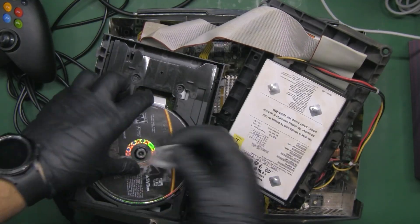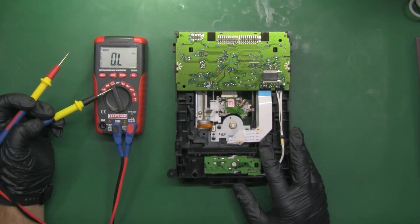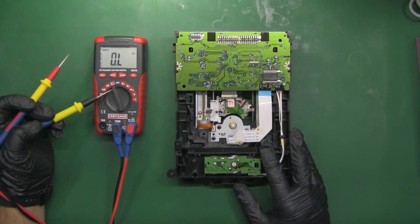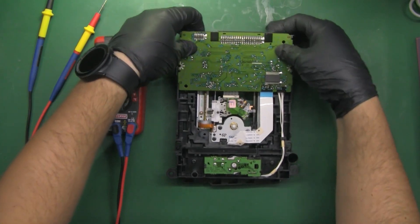For those of you that had seen my previous episode on fixing these Samsung disk drives, I had fixed similar issues by replacing the resistor arrays because they had gone out of spec. This is actually a surprising turn for this disk drive because I originally thought we were just going to do a recapping and I thought that would take care of all the ailments. I am hoping it is not the resistor arrays because I do not have resistors on hand. We also have our Craftsman multimeter on screen from a now defunct company called Sears.